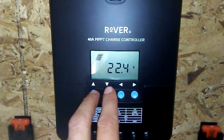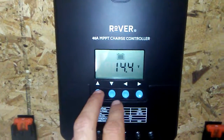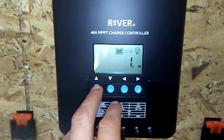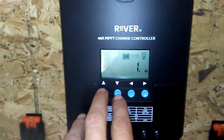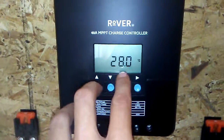Right now we're producing 7.56 amps — take that times 22.4 volts and that's how much wattage you get. Amps times voltage equals wattage. My battery is at 100 percent, 14.4 volts, usage is nothing. Amp hours coming in is 17, amp hours going out is 1.